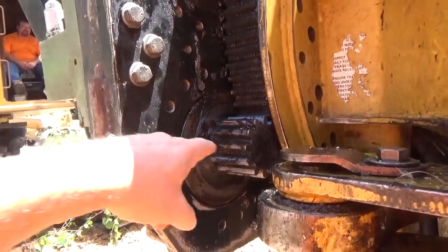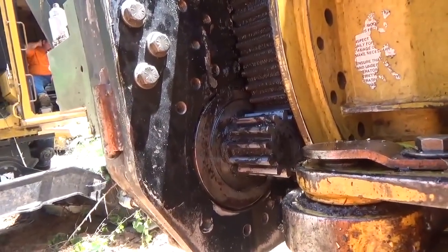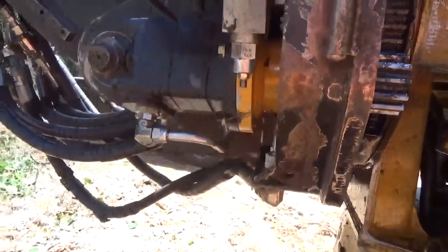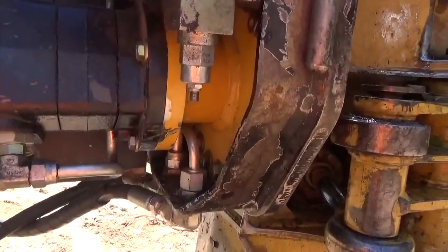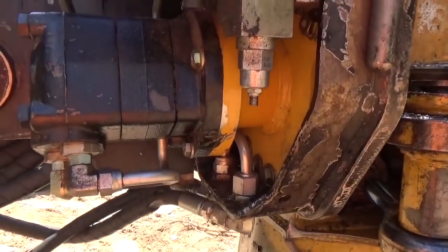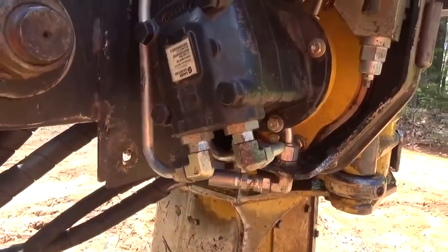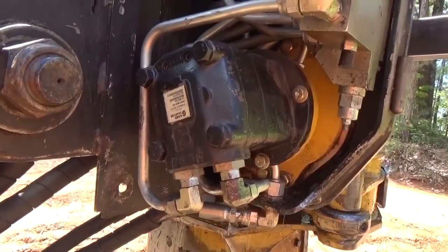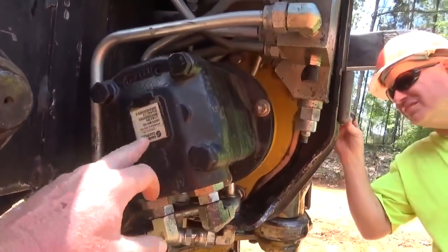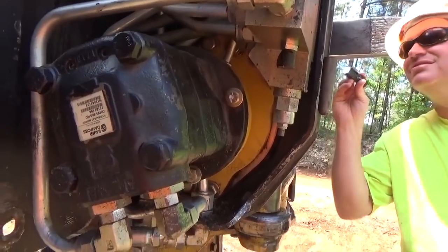Well, I imagine all that's one piece right there. That gear's made to that silver thing. Kevin said there might not be no pressure on that seal, but if that oil's coming out of the case drain — not less like Kenny said, that pump went bad, broke the seal out on it, and it's just pushing that over that hole. I'm going to say the pump went bad. That's a Danfoss — that's going to be the kind of thing in your drives on your processor head, Danfoss motors that are on them.